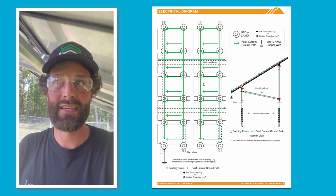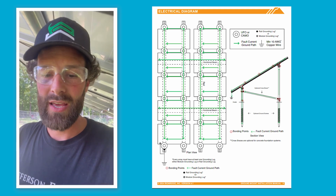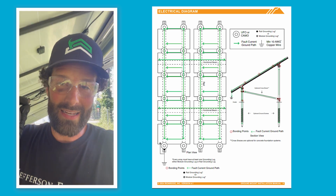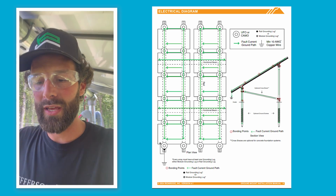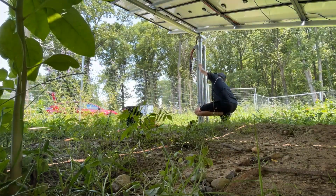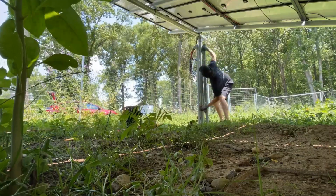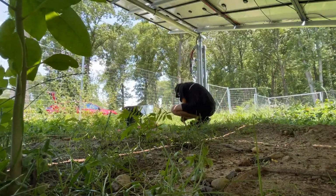My thought is this: if that was a supplemental grounding electrode, then 2 things would be true. 1, this would be a number 8 minimum conductor, which it is not; it is 10. And second, it would give clear indication of yet another grounding connection, which is the number 10 we have currently to the array. So I am reading between the lines here a little bit.